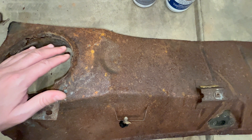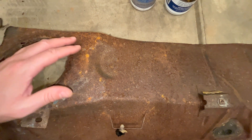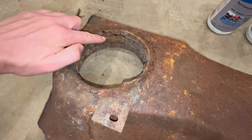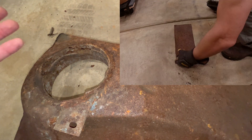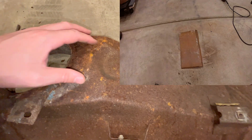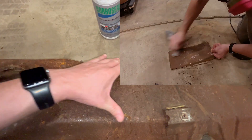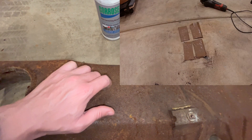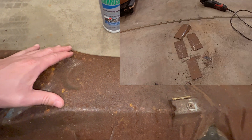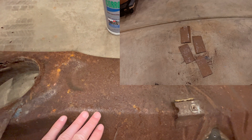I'm looking for a good piece to test this on. Obviously, if your metal is so far gone that it's flaking apart, you're not going to try to save it with a rust converter. So I'm picking probably this area here where it's nice and scaly, but still solid metal — still something that you might want to treat and save with a rust converter.